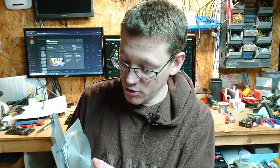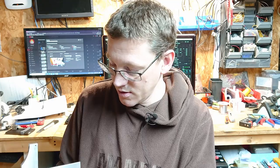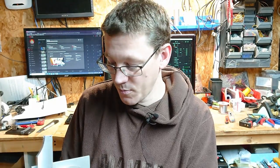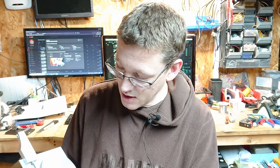A 1mm pitch screw, although mathematically it made for a good, sensible size wheel, and I could get 360 threads around the outside of this size disc, it's incredibly slow turning it round. I think my normal rotary table, which is just over here, is 4 degrees per rotation, so you only have to turn it 90 times rather than 360 times to get it all the way around.